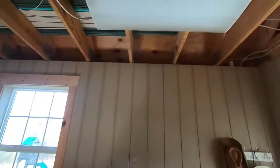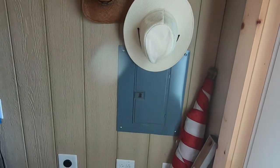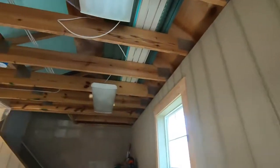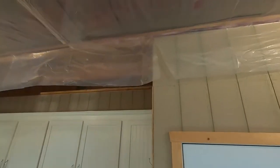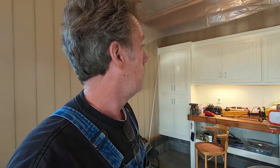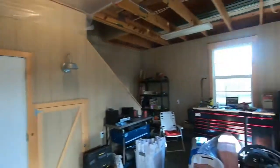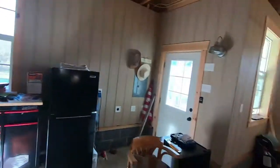Our first task this morning is we're going to have to take these lights down — I just put them up temporary after I built the garage. You can see the pipe up there that goes to my panel box down here. We're going to drop a piece of number-10 wire, pull it over here, come down inside the wall, and go across the top of these cabinets. We'll go outside with the refrigerant lines from the mini split — one hole in the wall — and then insulate. I've got a fan box there too. Let me get this place tidied up and get ready.